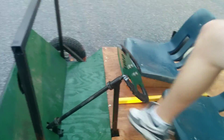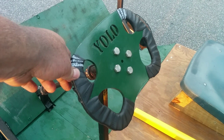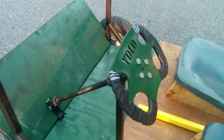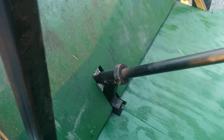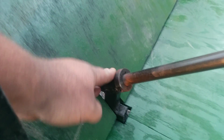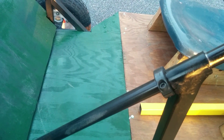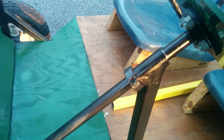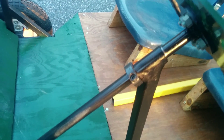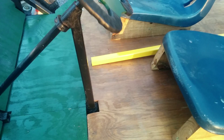The steering wheel was cut out of a three-quarter inch plate — YOLO, you only lay up once — because we did do a composite shell. One thing we learned: give yourself enough tolerances where you have mating surfaces for the steering. These are 0.8125 inches and the shaft is still the three-quarter inch cold rolled steel. Don't have a tight tolerance — when we had a tight tolerance we were unable to get good turning, and while the chassis is moving and flexing going down the hill it was giving us issues.